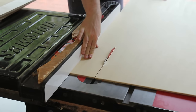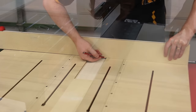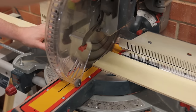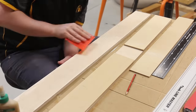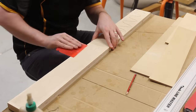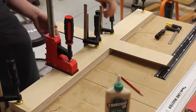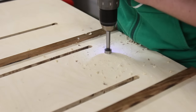It was then time to work on the front fence. I cut out the piece that will make up the final lamination and interchangeable zero clearance plate, then marked out the lengths that needed to be cut. Much like the sled base, the removable insert was used to position the outside portions — be sure to have at least one edge with nothing overhanging so that you can square it up on the table saw later. For the insert plates I'm holding them in with T-nuts and cap screws, so to get the exact location I used a 1mm drill bit to locate them, then counterbored with a forstner bit on the underside, then finally drilled a through hole. T-nuts need to be hammered in and I'll probably go back and add some CA glue or epoxy to permanently fix them in place.